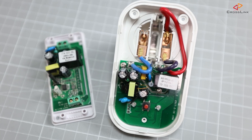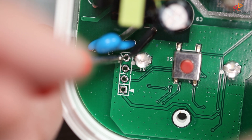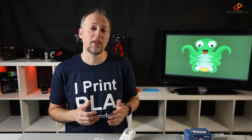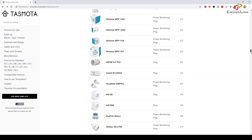What you will notice is that none of these boards has any kind of USB interface that you could use right away to flash new firmware. But if you look closer, you will see that there are some connectors — in this case unlabeled, though in some cases there might be labels like RX, TX, VCC, GND. The newer models seem not to have those labels anymore. Nevertheless, these connectors are the connectors of a serial interface that can be used to flash new firmware to the chip on these boards. The chip is an ESP8266, which is widely used in many smart home devices — a little microcontroller that's pretty versatile and powerful enough for a lot of smart home applications.